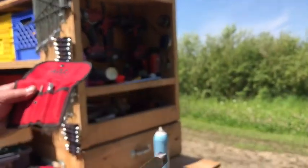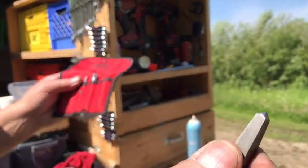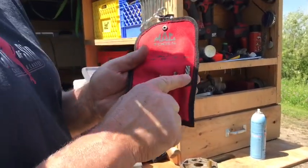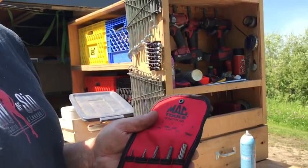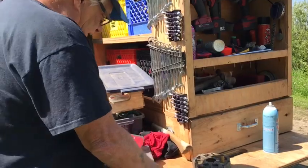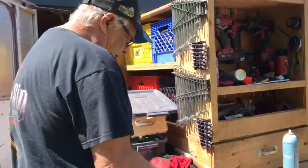So this is really made for soft metal. So you just tap it in these ones here. The more you turn it, the tighter it gets. And then it'll eventually, hopefully, get it out. Those are the 4 pieces I use mostly to get broken bolts out. If they're not stripped in there, you're all right. If they're stripped, it's a whole different ball game.